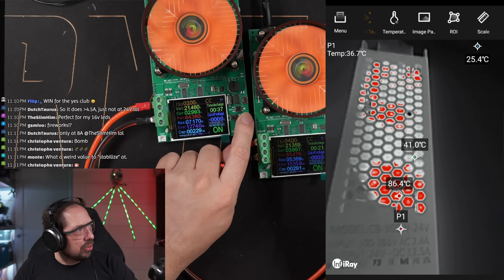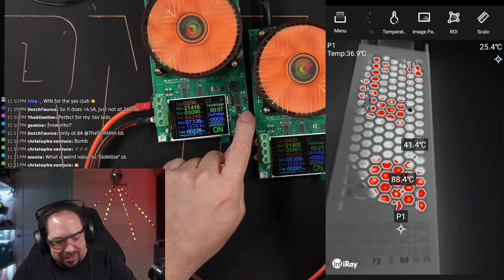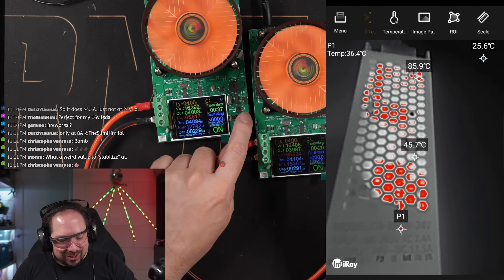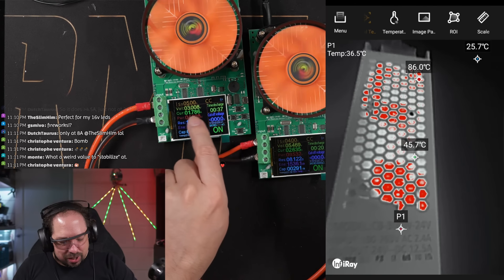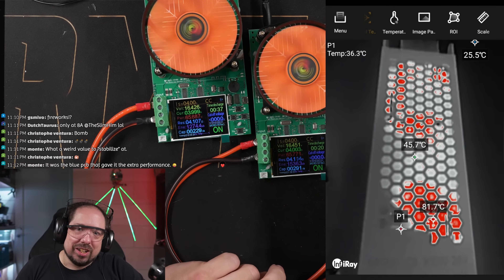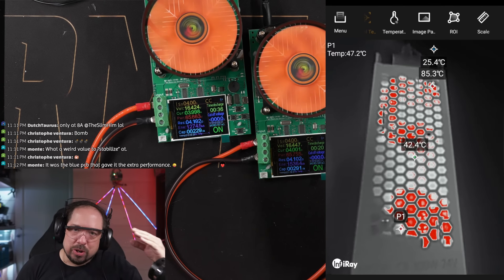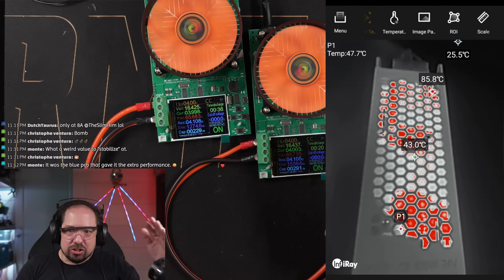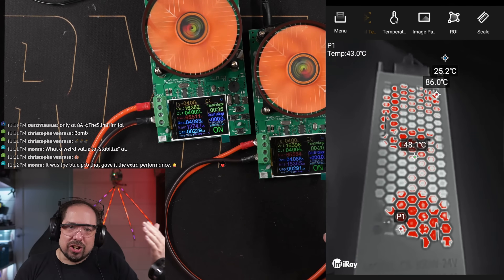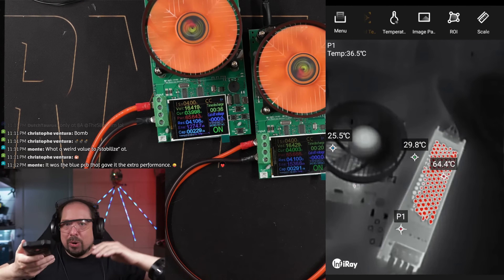Nine amps — that's crash mode. So that's probably why they say this is only for LEDs: because if the LEDs draw too much current, it just starts delivering a lower voltage, by which they start asking less current, and thus it auto-regulates to what the power supply can actually deliver.